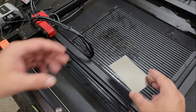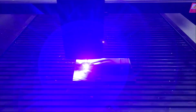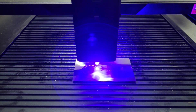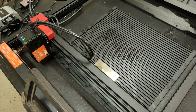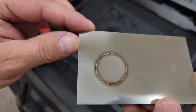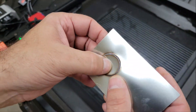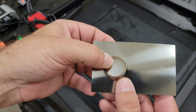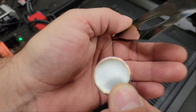I'll try that because I've never seen a 20-watt laser do that before. It struggled a little, but sure enough it can cut stainless steel. Of course this isn't useful for structural purposes, but in my case it's definitely good to know for future battery builds that require custom battery strip configurations.